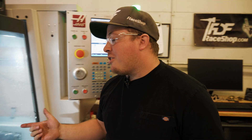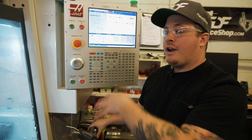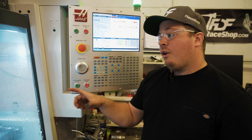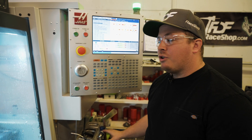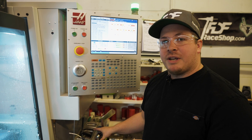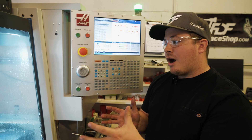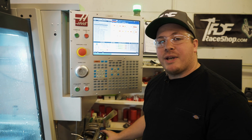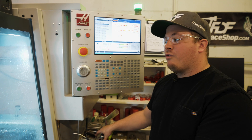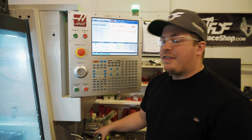You may have noticed that this tool is running a little bit slower. We use the same half-inch end mill as we do to rough out all the main material, however since we're only holding it down with two bolts now and we're also looking for a smoother surface finish along the wall, we just feed it a little bit slower. That will reduce the vibration and also reduce the chance of the part shifting or coming loose on the fixture plate itself.